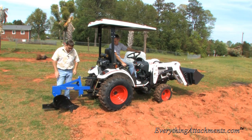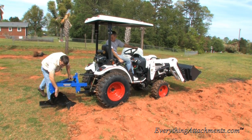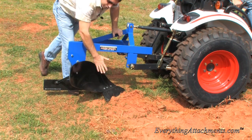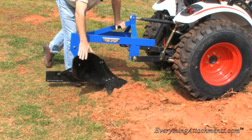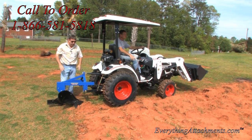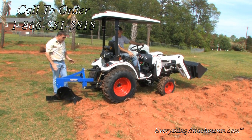It did great. This is the first one that we've got fully painted up and ready to go. If you'll notice, there's a special little bend in here to make it cavitate and get away from that plate, so if it's a little bit wet it doesn't stay sucked up to the moldboard. It's got an extra kick on the end — this is a duplicate of what used to be like an old Ford plow, and they were always known for being the best plows around here from way back.